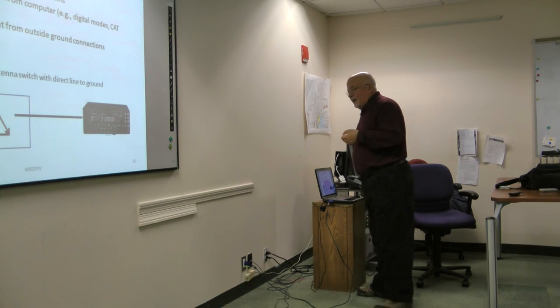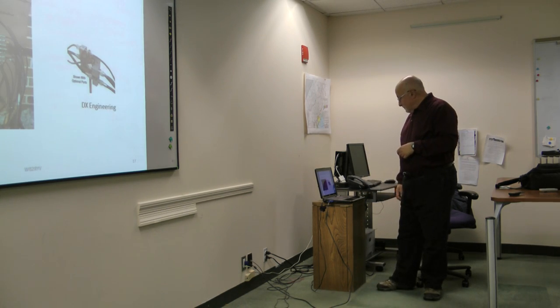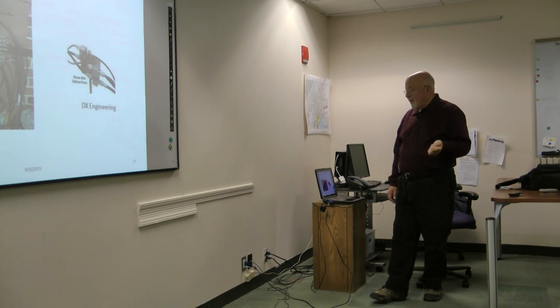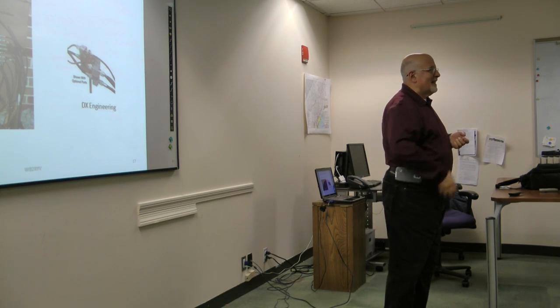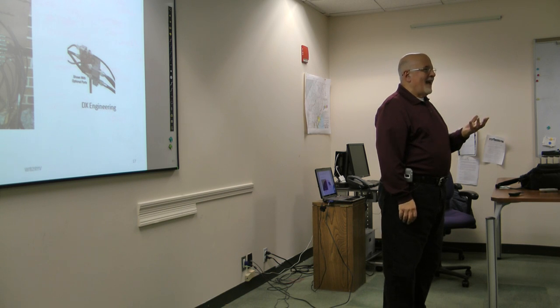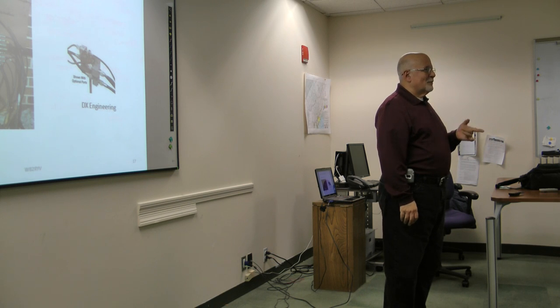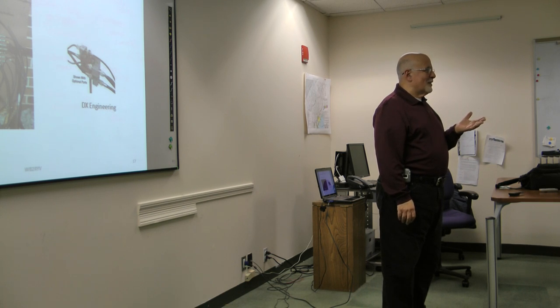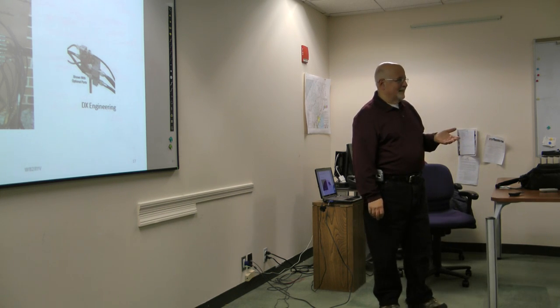The best way really is, take your coax, get it outside the house. And by the way, don't just throw it out the window, because you can get a nice super duper arc when that billion gazillion volts comes down to the end of that cable, and it'll flow through the ground. Or if it's near the house, it'll set the bushes on fire. So great, I didn't get it into the shack, and I didn't damage my $1,200 radio, but I set the bushes on fire, which in turn set the house on fire, and I lost the $300,000 house. So ground it.